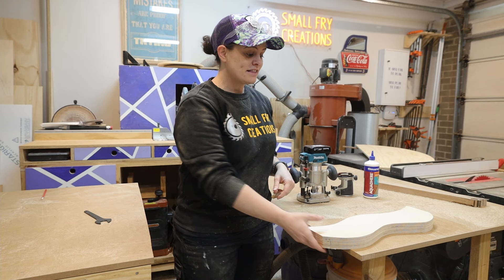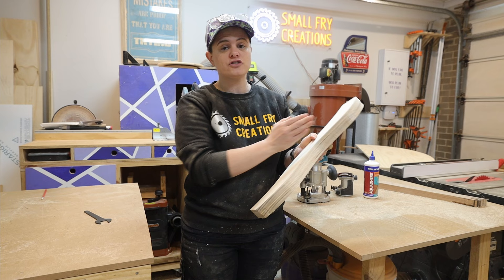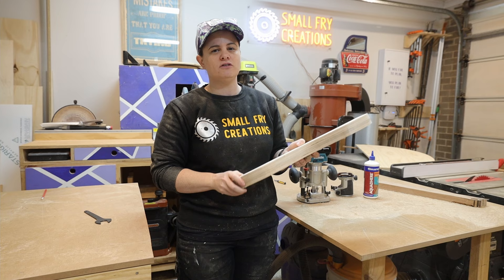Just like that you can take your master template and duplicate it over and over again — a really helpful router bit to have in the workshop. Its biggest drawback though is that you can't do internal 90-degree corners. Obviously with the router bit being circular that is going to be difficult, and it's something you should note when designing and planning on using the template router bit.